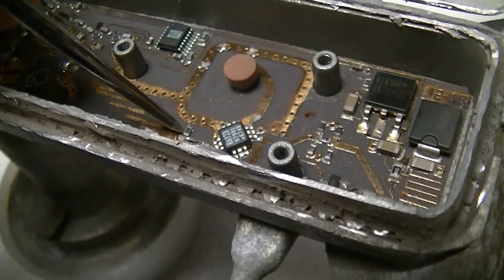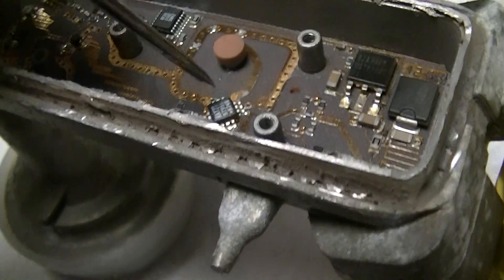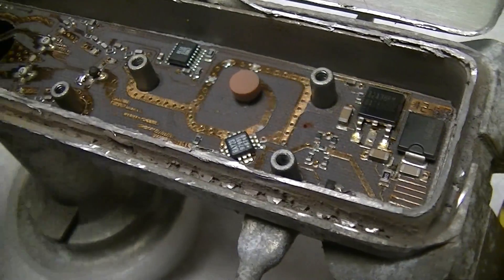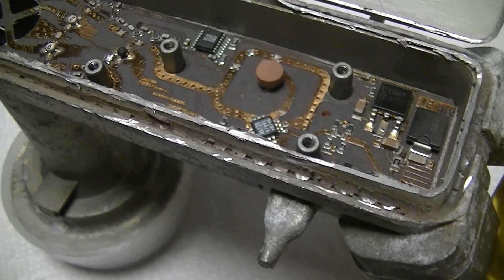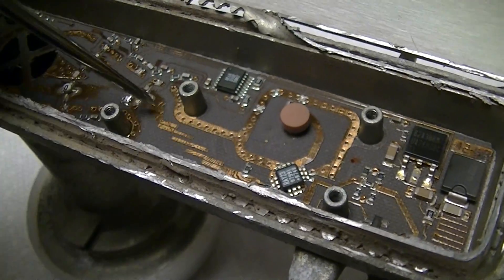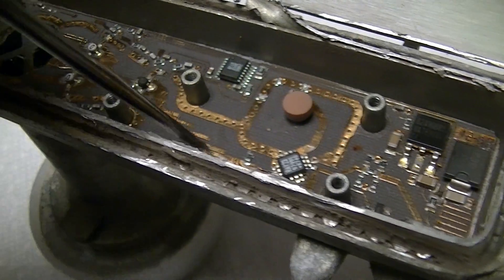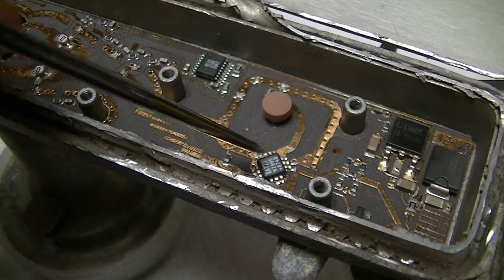There's a 100-ohm resistor, which is probably serving as some kind of impedance matching. I don't know whether this means the device is also 100 ohms and those two impedances in parallel form 50-ohm impedance, or this is high impedance and they need a low impedance output stage for this filter to work properly. Not really familiar with a lot of this black magic stuff.